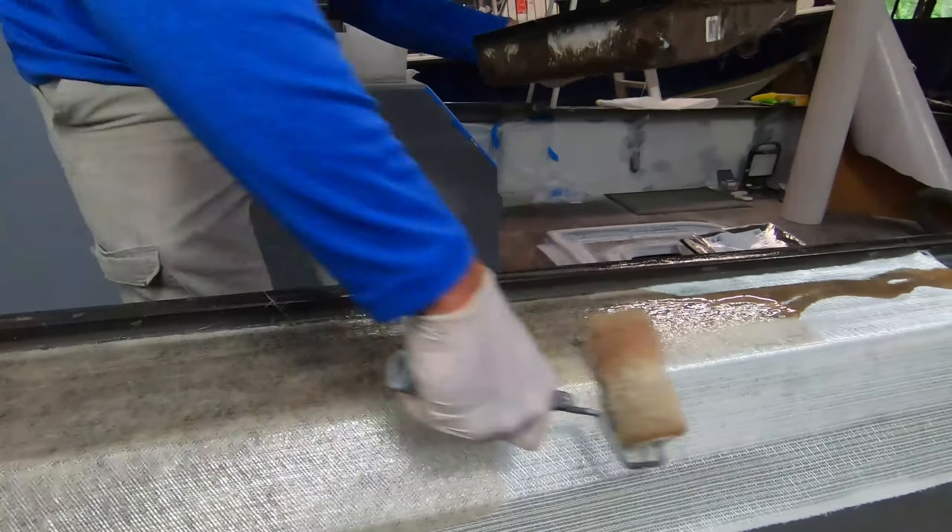I always like using the dyed catalyst — we add some red dye in there and it changes the color of the resin so you can see what you're doing. You can see what we're doing here — we're letting this mat kind of just feather right over that biaxial. We're going to trim this short because we have to stop today — I want to leave the biaxial edge exposed and trim the mat back. Sometimes that's just as easy as tearing it. Mark is already going down — I like to pat it rather than drag, because dragging will booger and burr the mat.